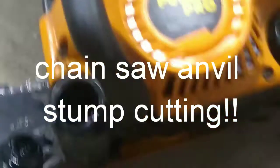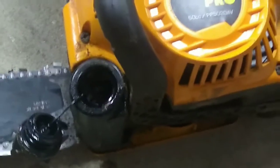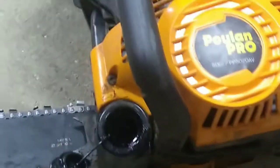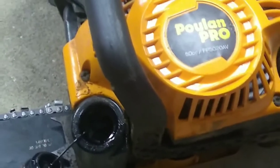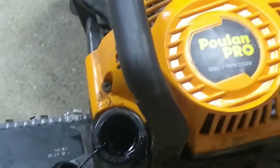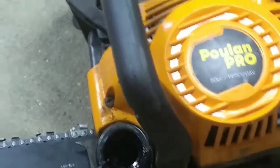It's good to always have some chainsaw files to sharpen your chain on a regular basis. I like to do it a little bit after every use — make sure my chain is sharp and tight and adjusted properly. You should always use the recommended bar and chain oil. I know some guys use transmission fluid or used motor oil, but you should really use the recommended chain oil if you want your chain, bar, and engine to last.